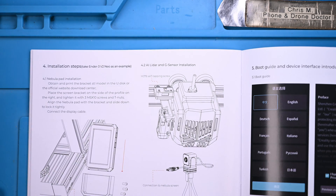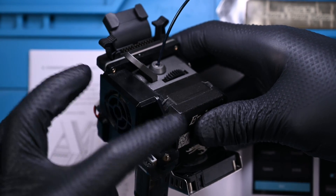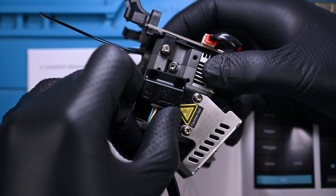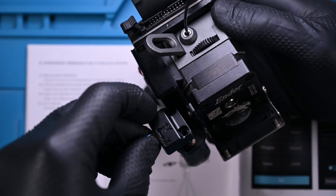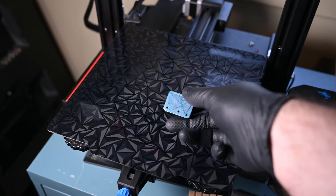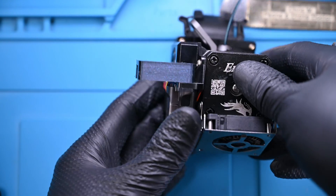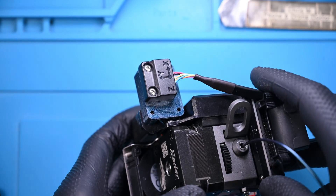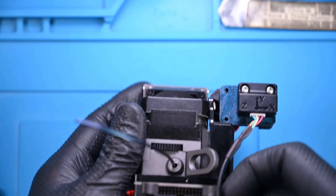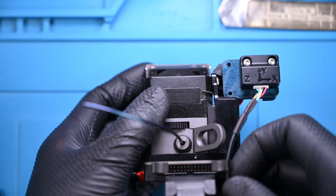The sensor needs to be attached to a conveniently placed bracket just above the touch probe. That would be great, except my Creality Sprite Pro hotend does not have this bracket, nor does my stock hotend, and it wasn't included in the kit at all. It's almost as if Creality designed this to be used with one specific printer but decided to market it as compatible with all. Thankfully, I own a 3D printer and can make parts for myself. I designed a little bracket in Fusion 360 that screws into the existing touch probe screws with an elevated platform to attach the G-Force sensor, keeping it perfectly aligned to the axes. If you also have a Sprite Pro, I'll include a link to this bracket in the description — but spoiler alert, you probably won't need it, because you may not want this kit to begin with.